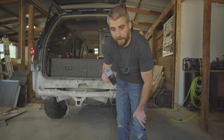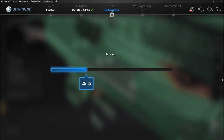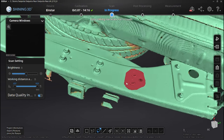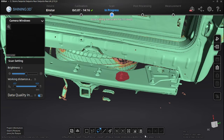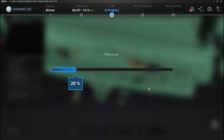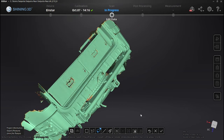There will be times when the scanner loses tracking and you'll get rogue pieces — like these two bolt heads. Pause your scan and use the tools below; I usually use the lasso tool, circle the rogue area, then use Ctrl+click to lasso and deselect the items you don't want, then hit delete to remove those scan pieces. Keep an eye on the scan whenever it loses tracking, then once you clean it up just continue the scan as before.